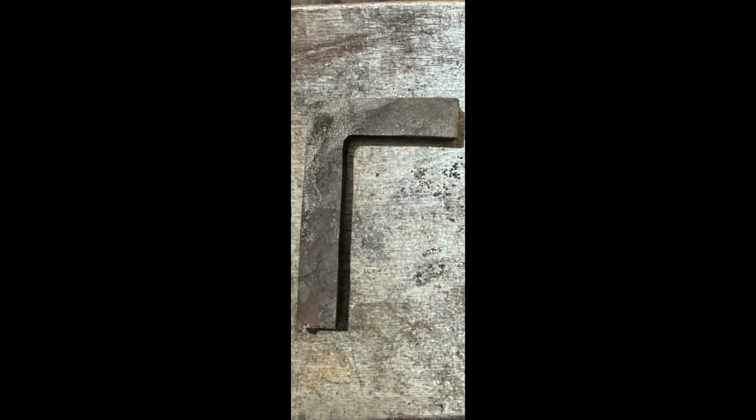The next one we're going to be doing is the soft bend method. The soft bend, you get a little bit of that square corner on the outside, a little bit on the inside, much more than what we were getting with the crease or fuller method.